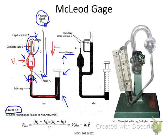And once you push the plunger downward to the most, you will reach an equilibrium state, where the fluid level has already reached the small capillary inside here. And also because the fluid will also be pushed upward along this tube, we will have another fluid level here. So those two interfaces give us two height readings. So you can read the height H1 and H2 here. So the difference of H2 minus H1, this is the final readout.